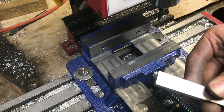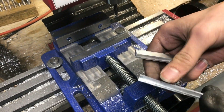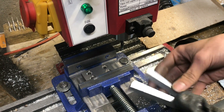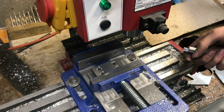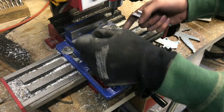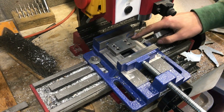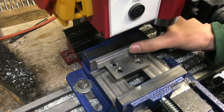I'm trying to make two bars of aluminum that are parallel and square — ideal. After I get the two bars of aluminum I should be able to use them as parallels in the future. These pieces here are tungsten from another project. I'm just using this larger piece of tungsten to cover up this gap so that I can set the aluminum bar on the tungsten.